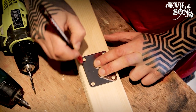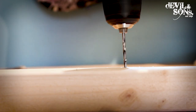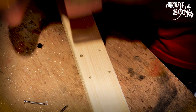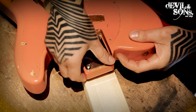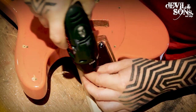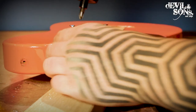I'm using a spare neck plate just to mark the four holes that go through the neck. This standard neck plate fits the guitar perfectly. Then I'm going to drill some pilot holes into here at the points where I've marked out, ready for the screw to then screw into. And now I'm going to screw the body down. I'll use the neck plate to protect the neck, put the screws lightly through the holes in the neck plate and the body, line them up with my holes underneath. I'm screwing each screw one at a time part of the way, then once they're all in, making sure they're holding the thing in the right place and it's not slipping, then I tighten all four screws. And this can work exactly the same by turning the guitar body round, lining up the screws with the holes, putting the neck plate in just to stop it scratching the guitar, and then tightening the screws.